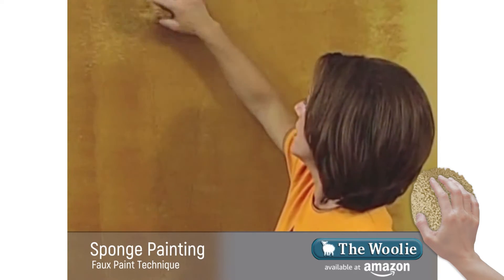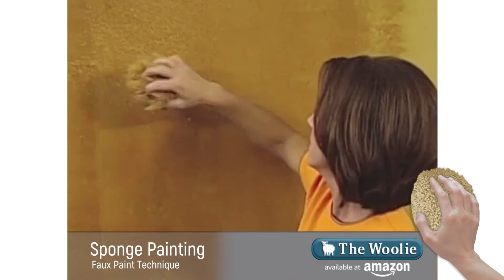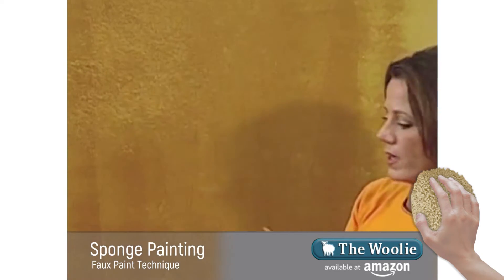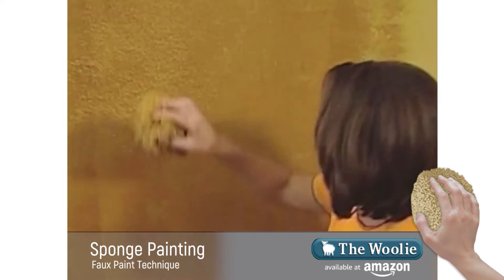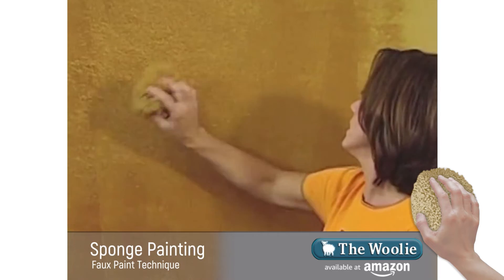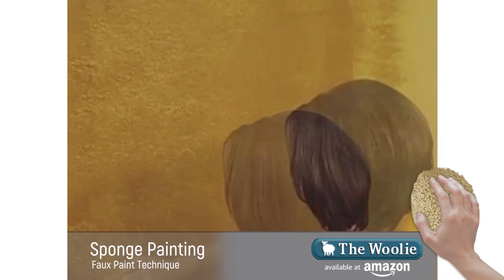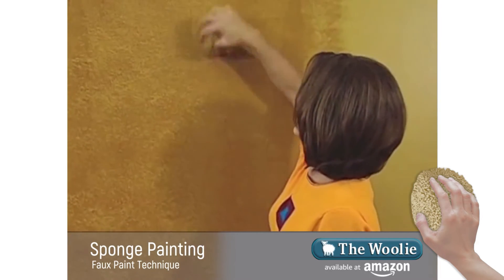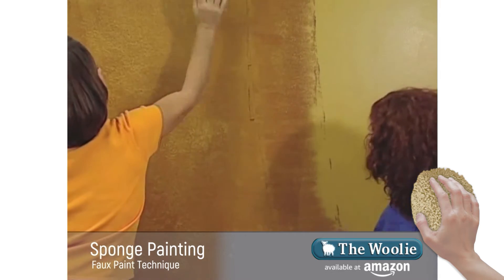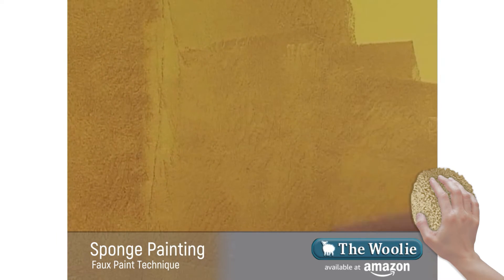I begin tapping, and I have a cotton cloth here that I'm going to use to blot off any extra glaze that I get on my sponge. So I just begin pouncing on the surface. When it looks like I've got too much glaze on the sponge, I'll remove it on the cotton cloth and begin pouncing again. Now this is a very subtle technique, but it is very beautiful, and it also goes very rapidly. As I get closer to the area that Amber's working, she's going to go ahead and continue rolling the glaze, which enables me to work continuously behind her so that we don't have any harsh lines of starting and stopping points.